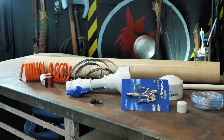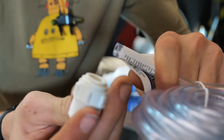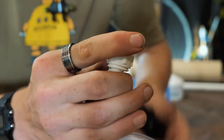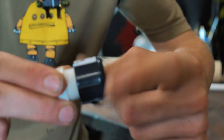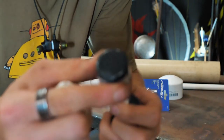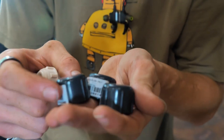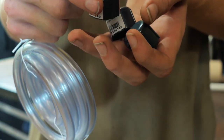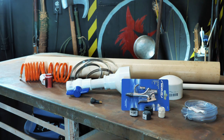Also one of these compression fittings that goes on the end of the tubing. We're going to use this to connect to some end caps that just thread on. My thinking is we'll drill a tiny hole in the end of the end cap — that's going to be our nozzle. I have three of them because I have a feeling I'm going to screw up the nozzle, and that way we can also test different size holes to see which one shoots the farthest. You could probably figure out something cheaper that works just as well, but this is what I figured out.